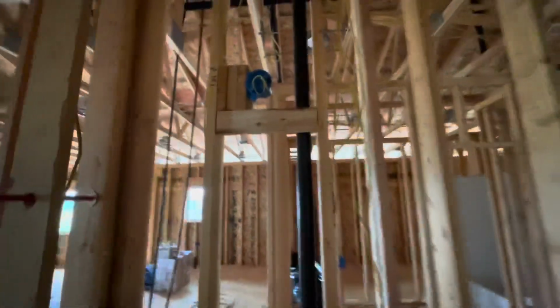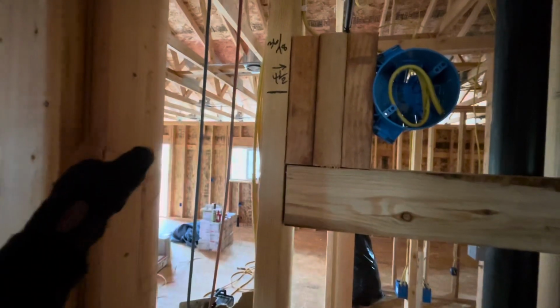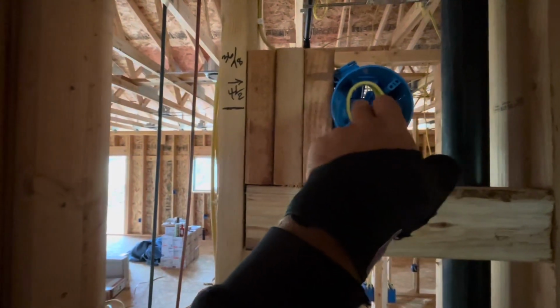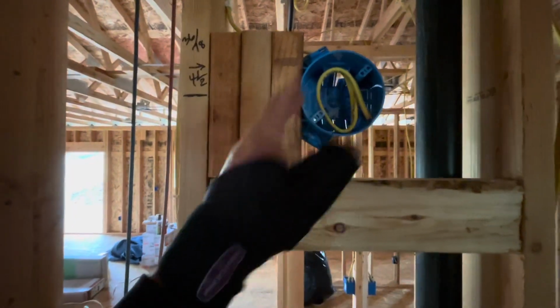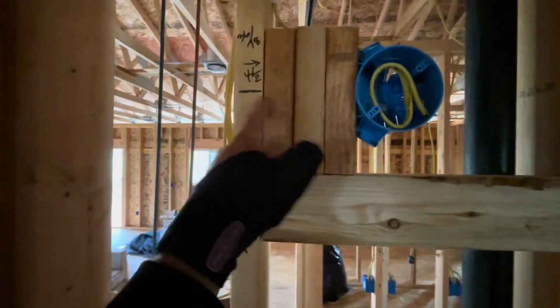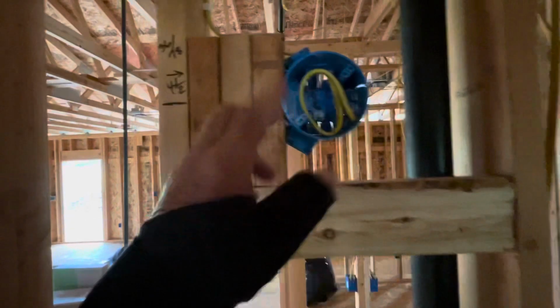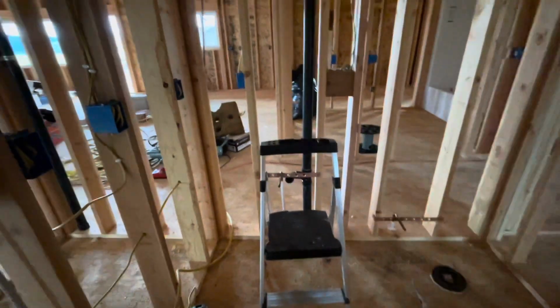All right, this bathroom vanity, I had to do some blocking. I think it's a 36 wide vanity, and 18 is right here actually. I'm going to custom build this one too, so I'll have to build it a little bit wider. I just realized 18 is right here, not right here. I thought, oh, perfect, 3 blocks, 4.5 inches over from here is 18. And I also put this block in first before I nailed that, so I had to bend it out, cut it, bend it out, nail this in. And as you just listened to me discover, I'm 2 inches off where I wanted to be. So this is now a 38-inch vanity. Good thing I'm custom building these, hopefully.